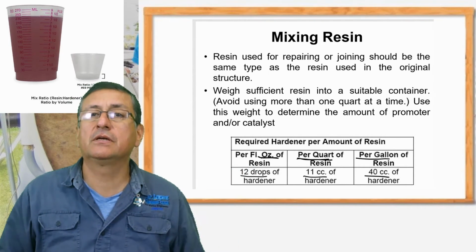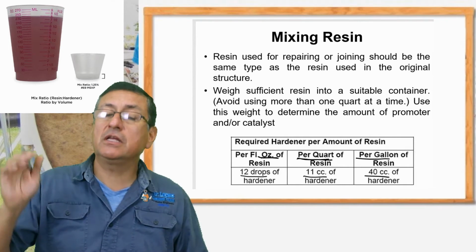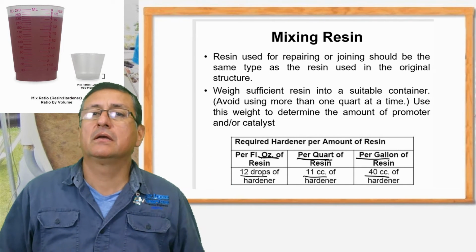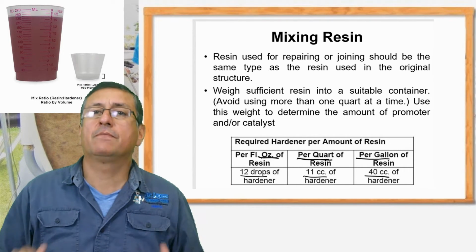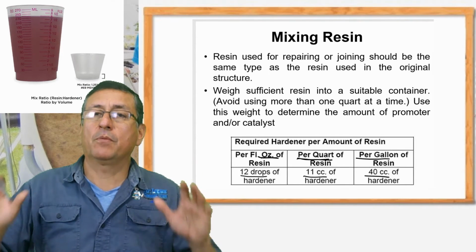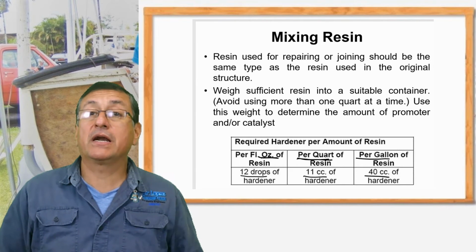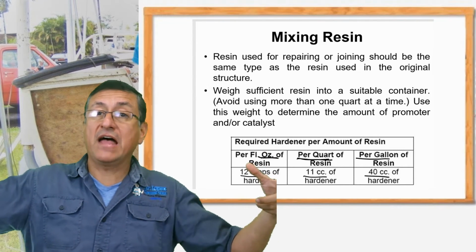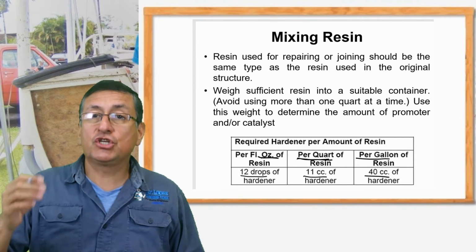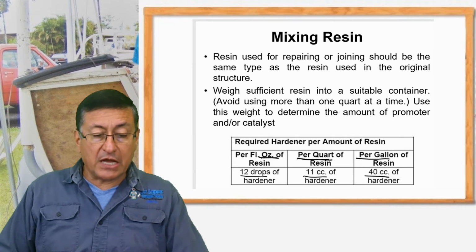That's your preference. Be careful with the temperature. Be careful with the humidity. If it's raining, I don't recommend it. I prepare on a dry day with a good environment, properly ventilated. Use the goggles, the gloves. Prepare the area. Prepare fans and grinders and brushes and rollers. Okay. All right. And we are going to start.